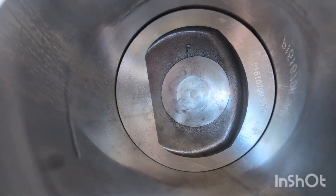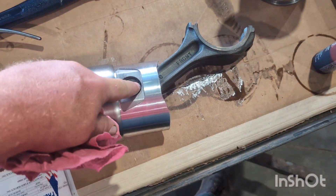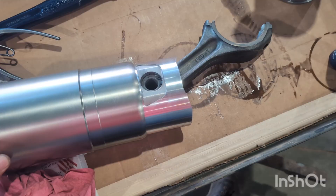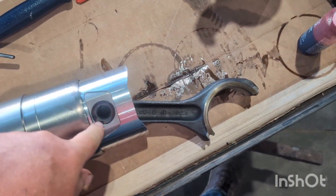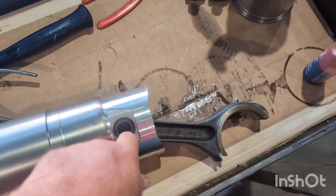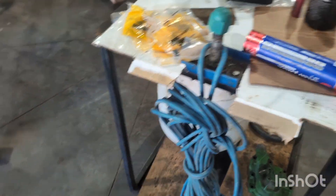The front — that little 'F' on the top of the piston — so they match up. Check the circlip snap ring, whatever you want to call it. Make sure your side is good, but also check the other side — on a couple pistons the other side was not in place. Roll it in the groove, and then we've got our new rod bolts in the bag.